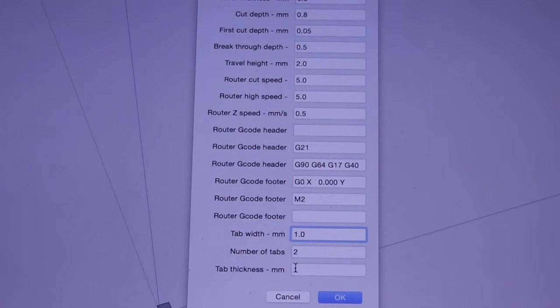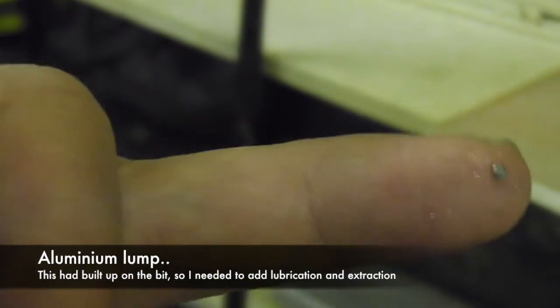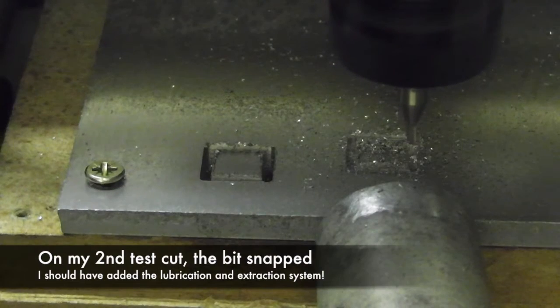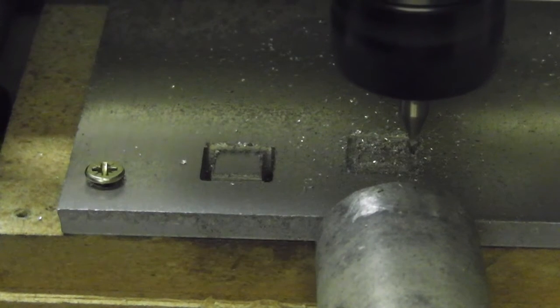The piece has tabs on which are created by the plugin. I noticed a lump of aluminium had built up on the bottom of the bit, so that told me that my extraction and lubrication really needed attention. On my second cut I tried to go a bit faster, but the bit snapped.